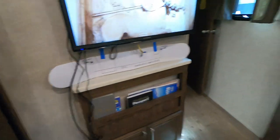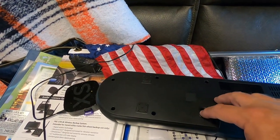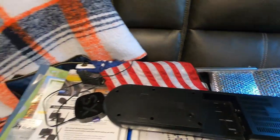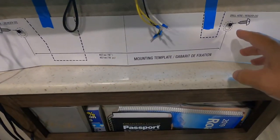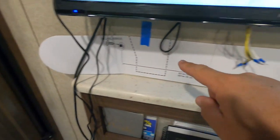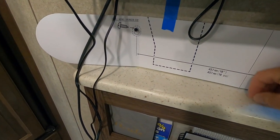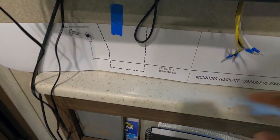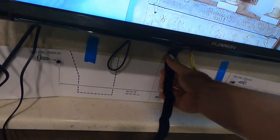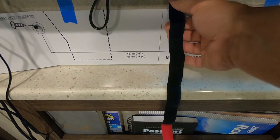The sound bar mounts to the wall like in a house — it's meant for residential use — and just hangs. There's no vibration, so it can hang on two well-placed screw heads, and that's fine. But in the trailer, obviously we've got a vibration issue. I've gotten lucky: the two mounting screws have hit studs — don't expect that to happen all the time. The template comes with it so you can set up perfectly where you want the mounting screws. I've lowered this enough so the sound bar will rest on this ledge, and I'm going to put a Velcro strap in the wall to go around the sound bar to help hold it in place.